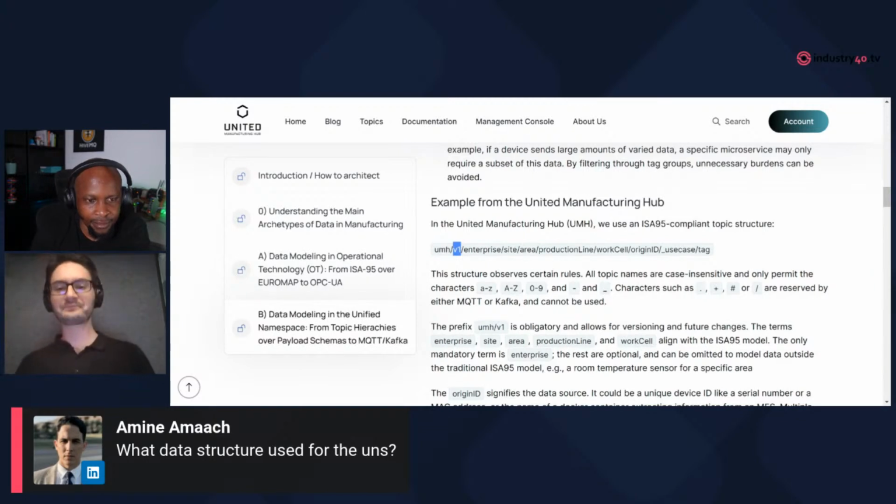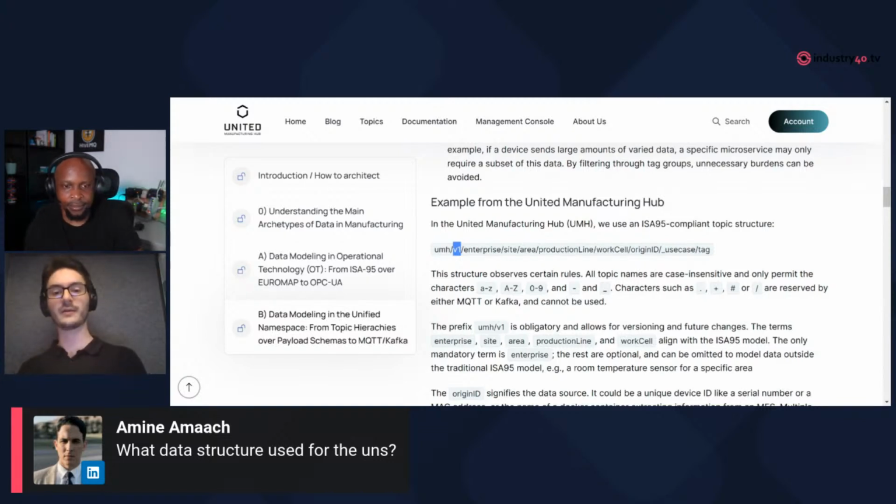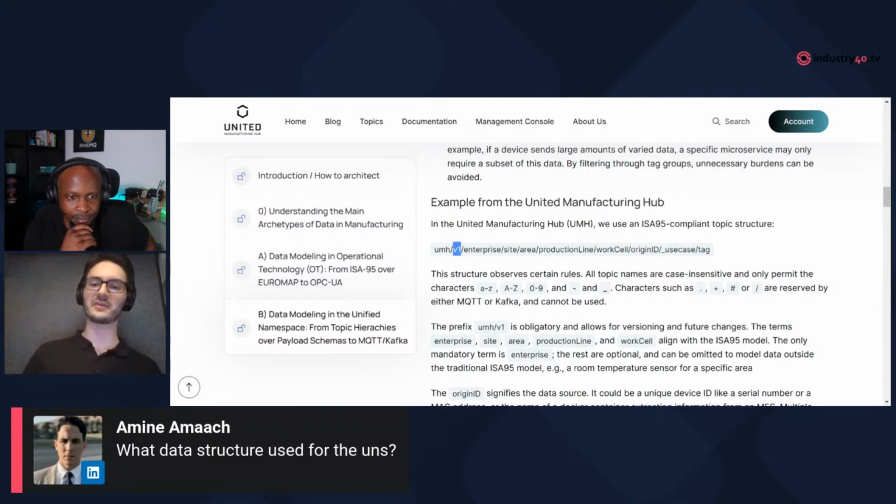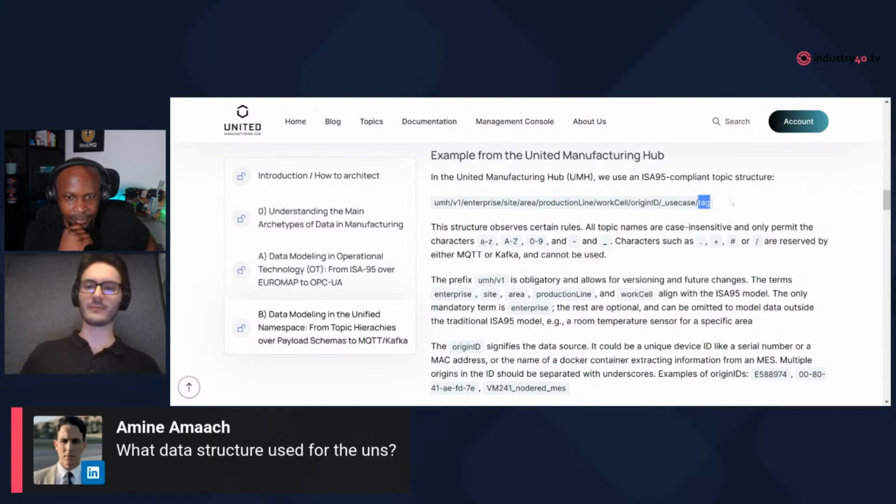And then after the ISA 95 model, we put in something we call the origin ID. In Sparkplug B, it's called device ID, to say where the data is coming from, what device it is. To explain why we have this structure, you could now subscribe to all the data for a single device, no matter which site, area or production line it belongs to. But you can also fetch all machines from a single production line. So with this, you can really filter it down, and with the following two levels, you can filter it down even more. At the end, you have the tag.